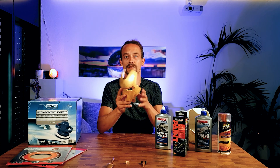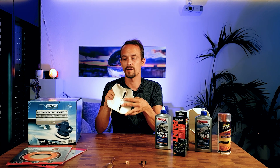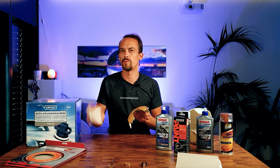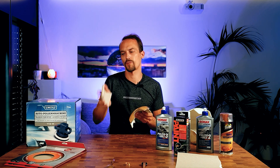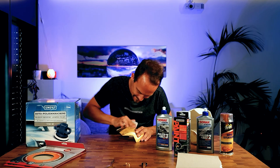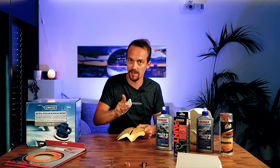So first let's get started grinding. Be sure you grind in every corner and get every angle. If your part is a little rougher at the beginning because it's fresh off the printer, use 80 grit, 120 grit, and work your way up to 320 and 600. Remember, get every angle and every corner.